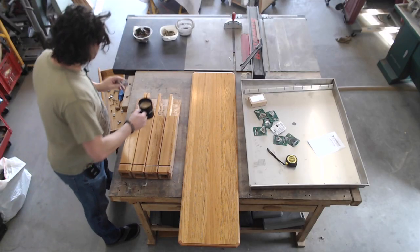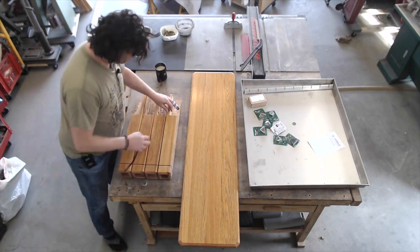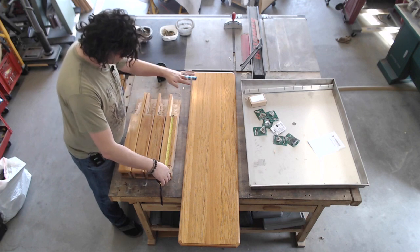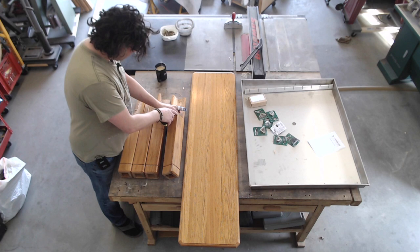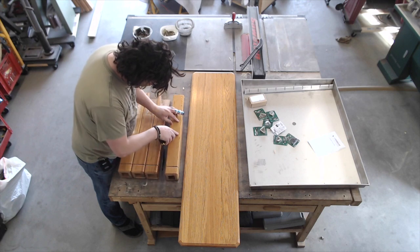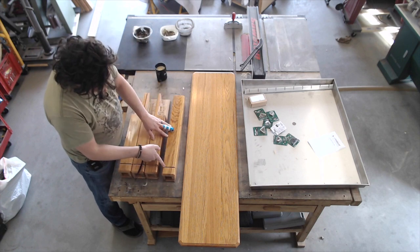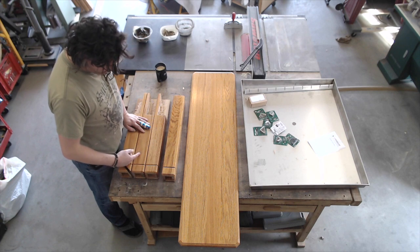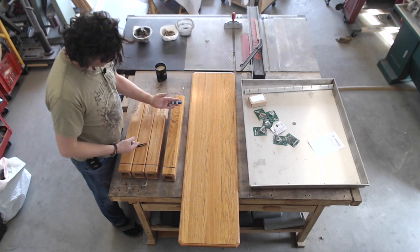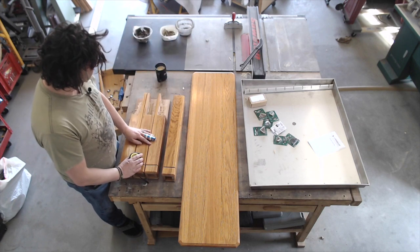I think I've decided on an approach. I'm looking at chopping these legs down here to lose the nasty bit. This is solid oak, 17 inches high, so it makes a nice little side table for a sofa. I was hoping to just trim an edge off to lose these bevels, but I think it's being nailed together and filled — I can see the fill marks. I don't want to ruin my saw blade, so I'll leave that. I might chop this one bit off, and then chop it in half to have a top part and a little shelf halfway down for books or something. To the table saw to do some cutting.